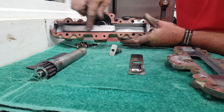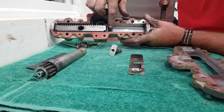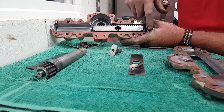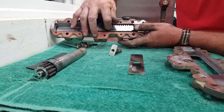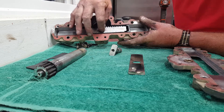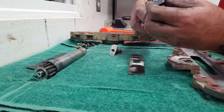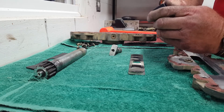It's hitting this way but not the other way. If you steer hard enough — hit a ditch, rock, stump, something that grabs the wheel out of your hand — it hits the end and can either break the gearbox or break the head of the screw off, then the bushing drops down. In this case it didn't fully drop, it was still holding on to the end, but the end of the bushing is wallowed out. It's almost just ready to pull through — I could probably pull it off and ruin it.